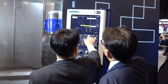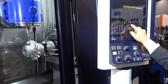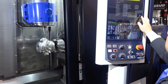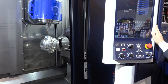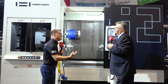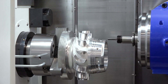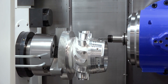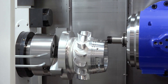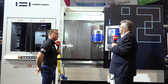This machine is very complex so it's not easy to program, but with Harmony you can program it right here on the floor. Three things are important to reiterate: matched spindles — meaning it's not a sub-spindle where you lose power and strength; the precision of the B-axis head itself; and the rigidity, torque, and horsepower. You're incorporating all of this — it is not a secondary spindle — and the main spindle still has full torque and precision.